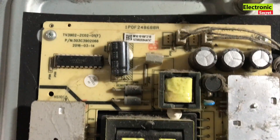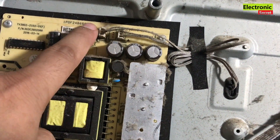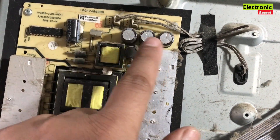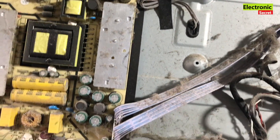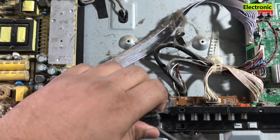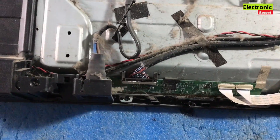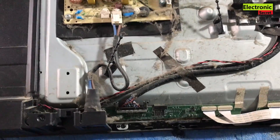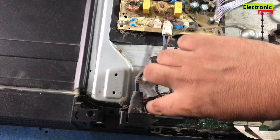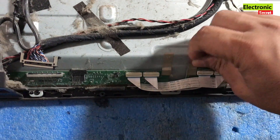There are backlight connectors here. Firstly, you have to check the capacitors beside the backlight driver jack, because if they are bulgy then replace them and your problem will be fixed. When you open the back cover, you can first examine the power supply or motherboard where the backlight connectors or wires are connected. If there is anything short or bulged, replace them.